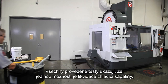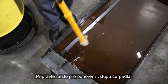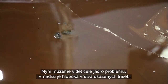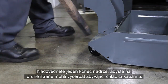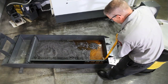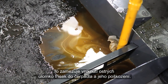All these tests confirm that discarding the coolant is the only good option. Clear a spot for the pump inlet and pump out the dirty coolant — now we will see the full extent of the problem. There is a deep layer of chips. It helps to raise one end of the tank to drain the remaining coolant to the other side. Note that we have a mesh screen around the end of the pump inlet; this keeps the sharp chip fragments from damaging the pump.